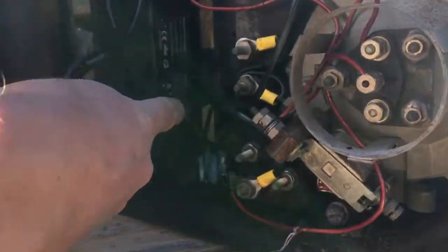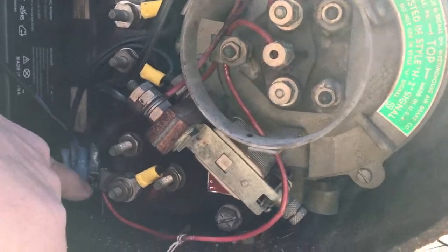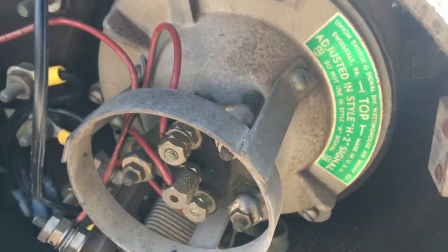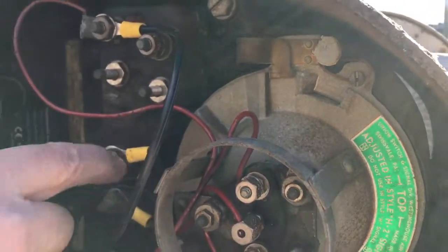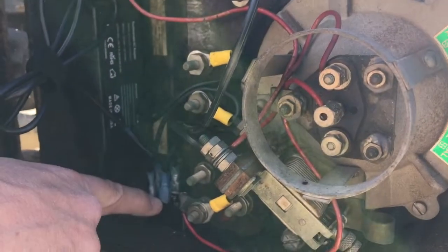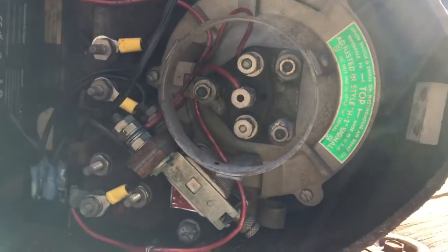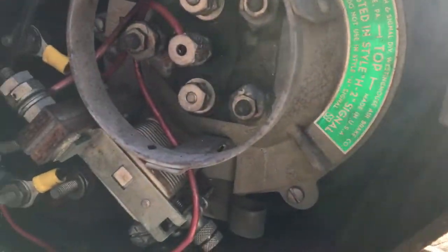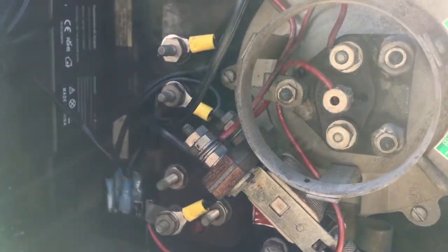So here's your 110 going into this charger and then this adapter. I'm assuming it is, oh here, yeah, this is a 12 volt adapter. So you're plugging it into 110, it makes 12 volt, puts it into here, and then this is going to your bulb, so that's what this is for. And then here are the wires going to the polarity, and then there's a 3-way switch here that's switching that. Right. Okay, so here's your positive, bulb, and that's your minus. And then this is what changes the color. The rest of these are all for relaying to other signals and stuff. You don't need to worry about that. I see. So it's just these 2 that go to the bulb, and these 2 that go down to the switch. But the problem is it's broken. Again, the toggle switch is broken.